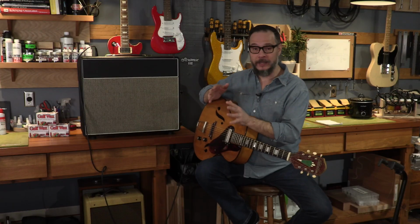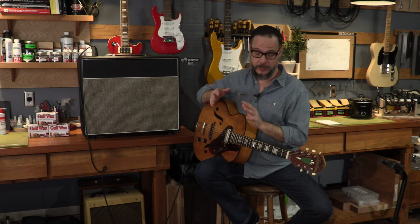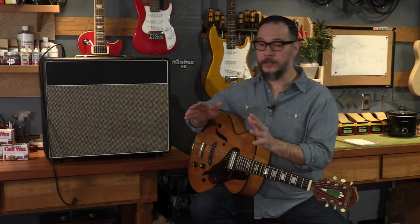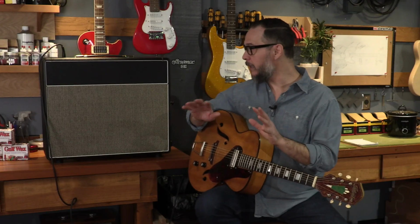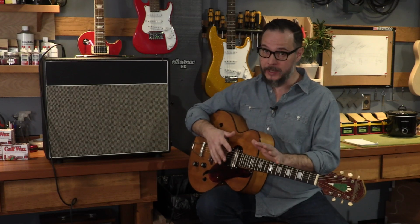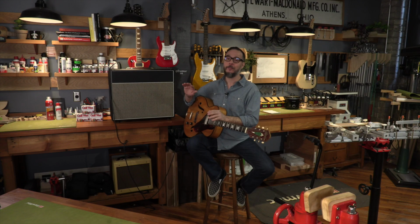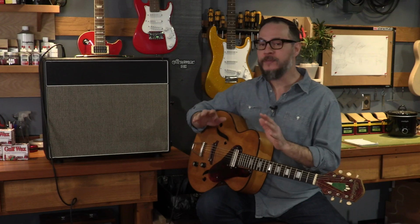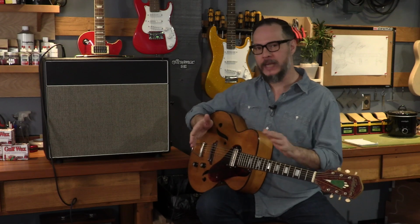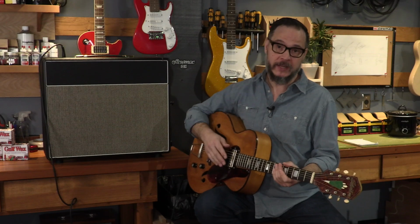There's no howling or obnoxious squealing, none of that microphonic feedback we heard to begin with. Now, obviously, you still hear a little bit of hum there. That's all normal electronic interference that you're going to pick up on an old guitar with a single coil pickup and an amp that's in a studio full of lights that's turned up way too loud. The point of the string ground was so we could kind of get that a little bit under control. When I touch the strings, it does get better, and that's what I expected to happen.